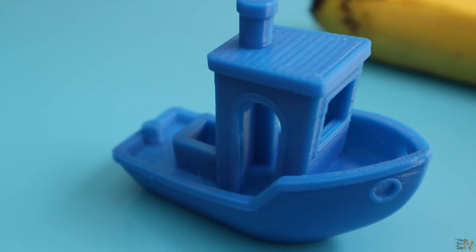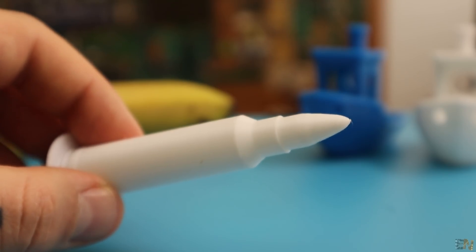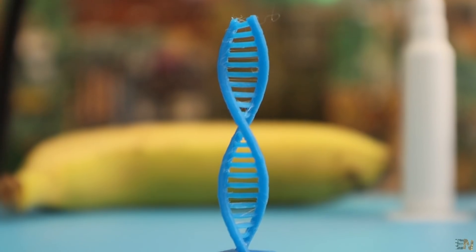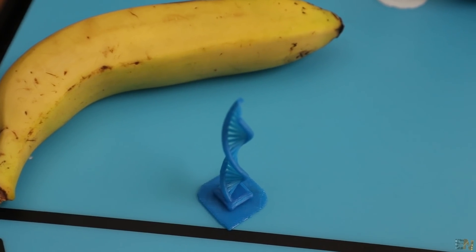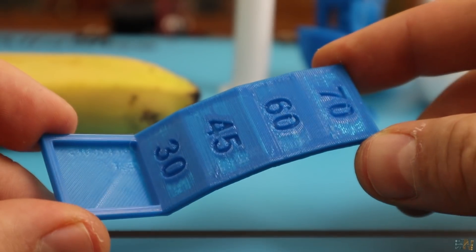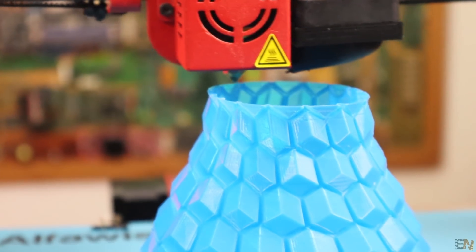The final benchy turned out impeccable with perfect layers, using a 0.4mm nozzle and 0.2mm layer height. I've also printed a bullet with white PLA material and it turned out okay, with good layers even with the white PLA sample. To test for small parts, I've printed a DNA example and the angle test — this part is very small, banana for scale — but even so, the small layers turned out okay. Both prints turned out very good, even with thin prints and up to 75 degree angle. I've also printed a vase using spiral print and the printer made a good job, so spiral vase printing also works okay.